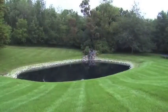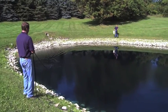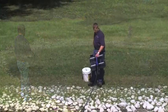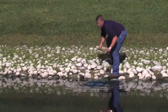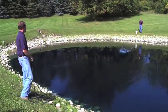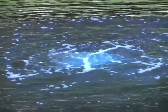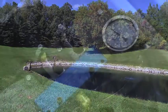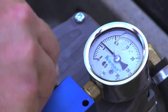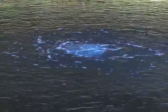Once you're comfortable with the diffuser placement, repeat these steps until all diffusers are in position. The second diffuser installation option works for smaller ponds where you may not have a boat or raft. One person stands on one side of the pond while the other walks the diffuser around to the other side. A nylon rope is then looped through the diffuser — do not tie the rope to the diffuser. While one person pulls the diffuser by the airline, the other guides the diffuser using the nylon rope. Once the diffuser is in the correct position, release the nylon rope and pull it to shore. Repeat these steps for all diffusers. With systems having multiple diffusers, you may see a difference in the amount of bubbles coming from each location. The diffuser in the deepest water or with the longest run may require more pressure, so adjustments to the valve should be made for maximum performance. Once adjustments are made, wait several minutes to see results at each diffuser location.